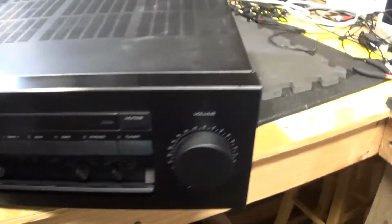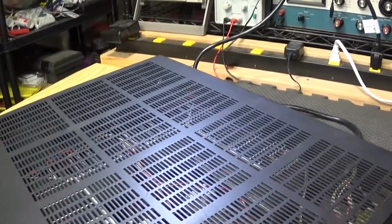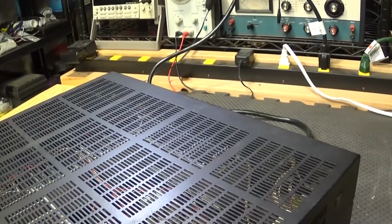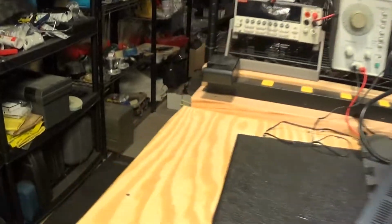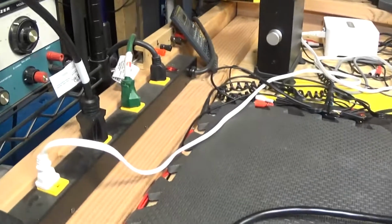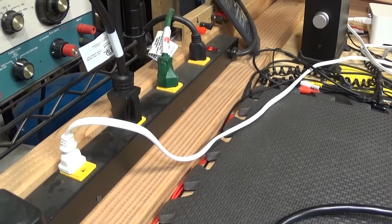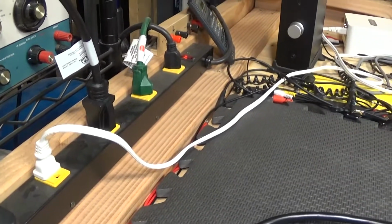Okay, well, anyway, I hope someone found that to be beneficial. Like I said, I think it's well worth changing out the power cord. That other one was like 8 feet of power cord that was such a small gauge wire, and not only that, I've now got it properly polarized so that the hot wire is switched by the power switch, which is the way it ought to be.